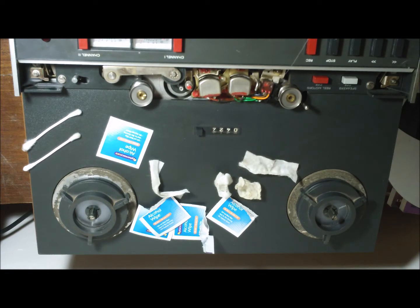You can see it's getting quite clearly attracted to all the metal parts, in particular the erase head. The main problem with this recorder is that if I try to record over old tapes, the old recording is there faintly in the background — so the erase head wasn't working properly. As you can see, these parts have become magnetized over the years by having magnetic tape dragged over them.